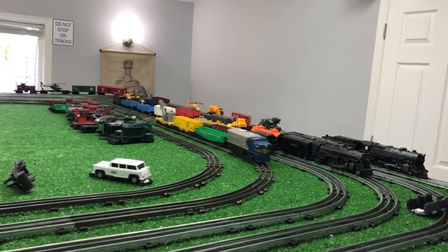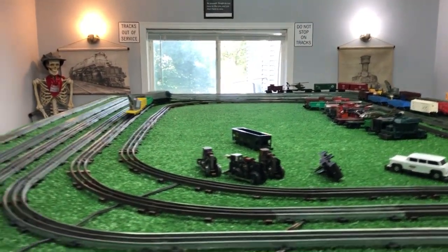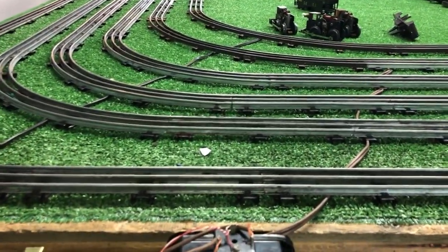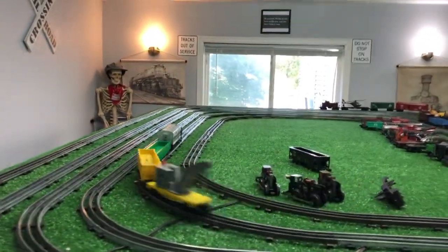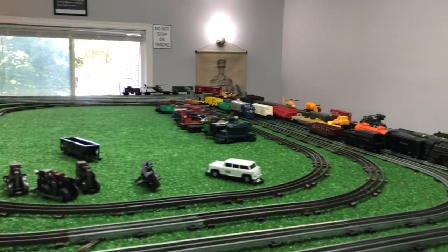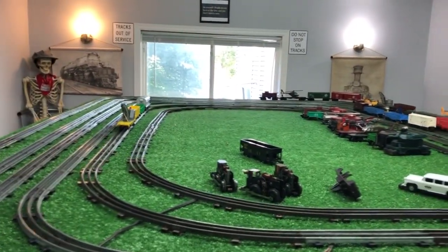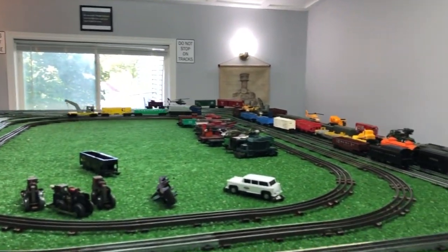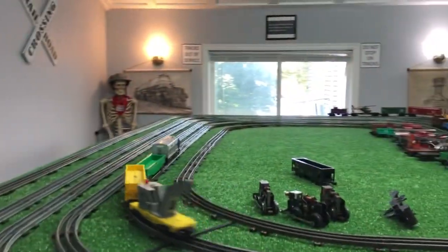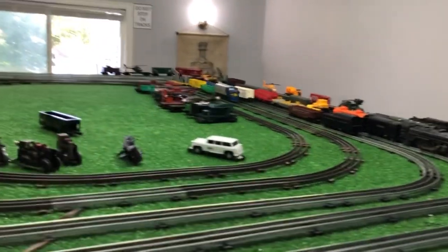We have plenty of power available. And if you want to go back to AC, just connect the lock-on directly to the transformer instead of going through the rectifier. I might actually put a rectifier inside the case and just have a switch to switch between AC and DC. Just continuing the DC experiments — this thing runs absolutely splendidly on DC. Every locomotive I've ever tested on DC runs better on DC than it does on AC.